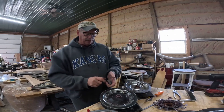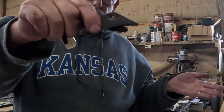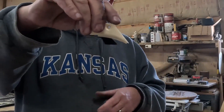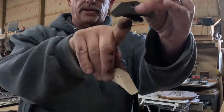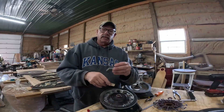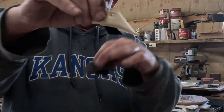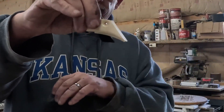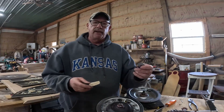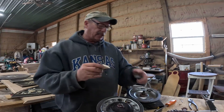I'm going to show you what mine looked like. There's the one that was actually in the meter — that's what I had. This is a brand new one. Night and day difference, isn't it? You can see how this one has had hundreds of thousands of seeds bypass it. This worn brush was probably doing nothing for the most part — it might have helped a little bit here and there, but this is the brush that also needs to go in.